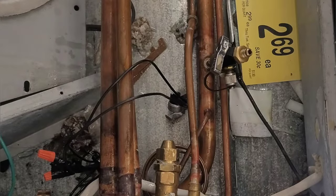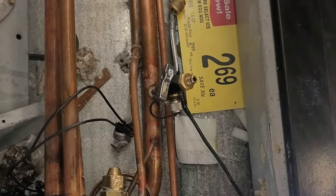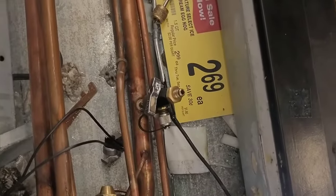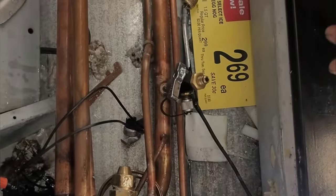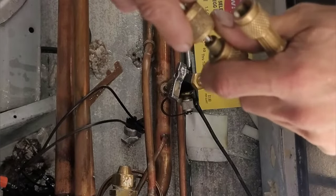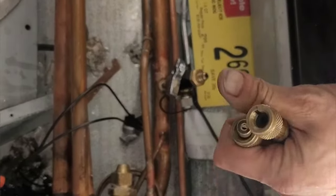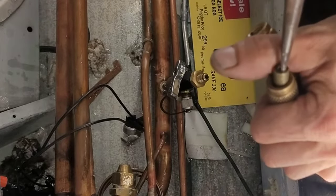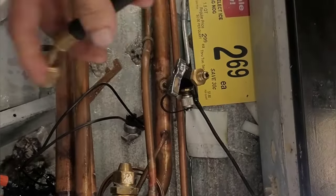So you take that out so that your refrigerant goes in there faster, because it's liquid, you know? So let's get your hose, take out the thing, whatever it's called. The valve core depressor. Needle nose seems to work pretty good usually. There we go. Now it's gonna flow.